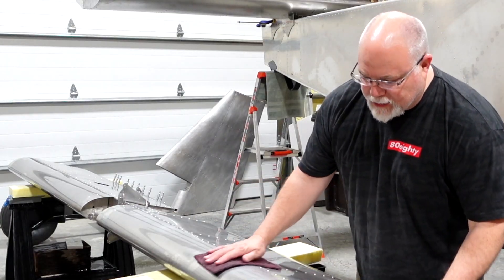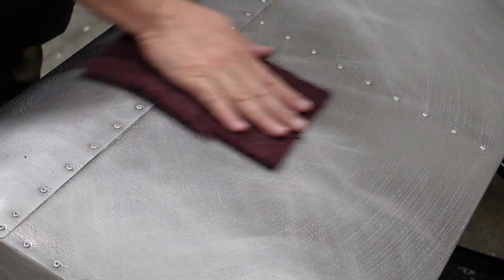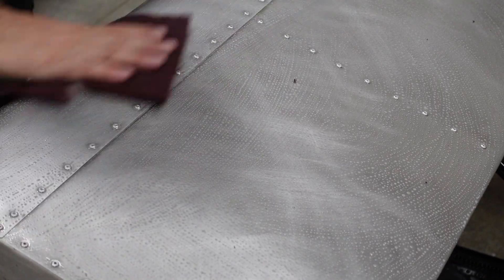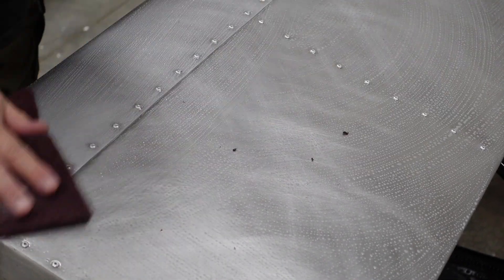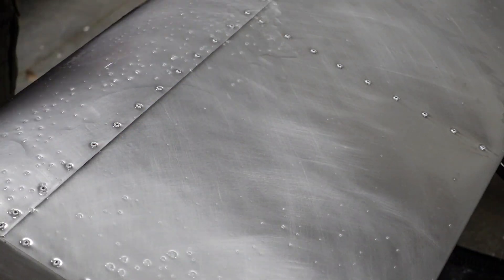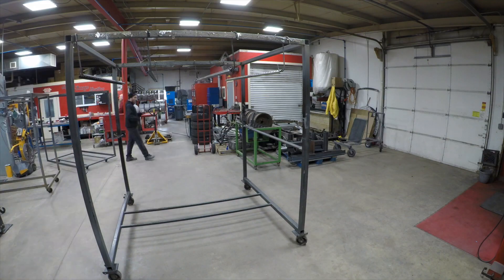We're getting the skins prepped here for powder coating tomorrow. With each consecutive pass you end up taking that down just a little bit more. The water and the scotch brite combined together help work away at those ink markings until they're basically totally gone, because you don't want to leave that ink on there — it'll actually come back through even with powder coating. The heat can release those inks and they'll essentially soak up through the powder coating, and you'll end up with the letters showing through. So we definitely don't want that.